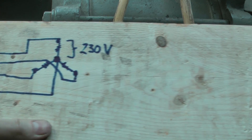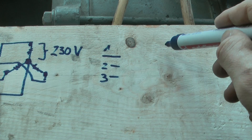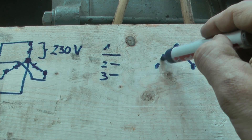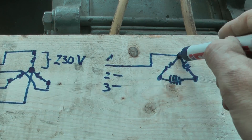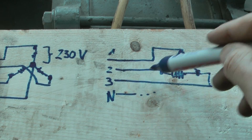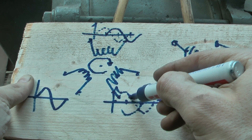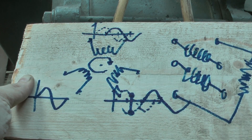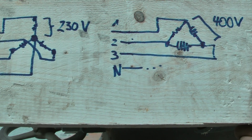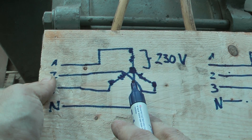There is a more powerful way of using that motor. It starts again with three phases, and then the three circuits of the motor are put in between three points of a triangle. That way one phase goes here, a second one here, a third one here, and the neutral isn't used — because the three phases have this one-third and two-thirds delay between each other. You can see that between this point and this point of the delayed function is more than the amplitude of one, so this is nearly 400 volts.